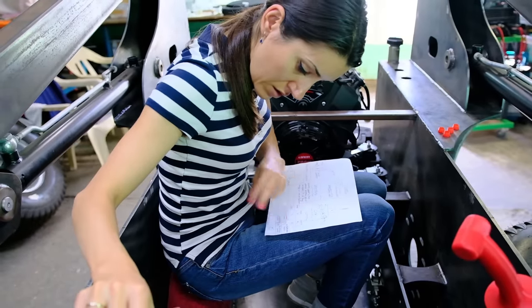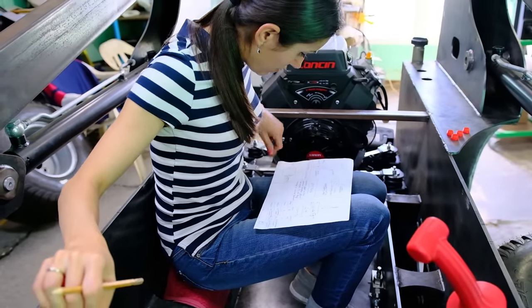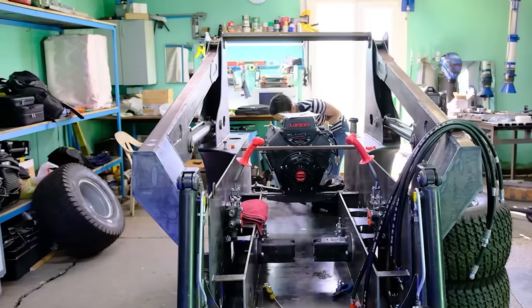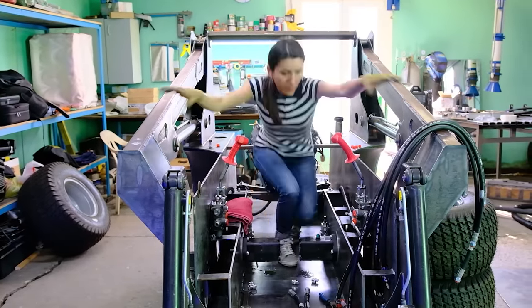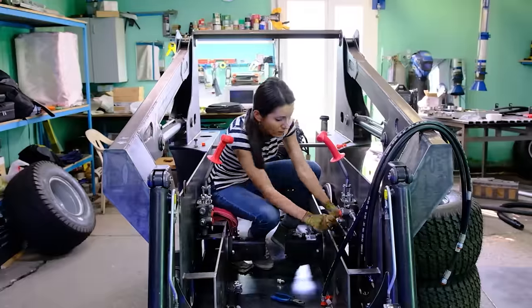In order not to get confused when connecting, I marked all the hoses and made a visual schema indicating which holes on each unit one or another hose connects to. Then I connected the first, already crimped batch of high-pressure hoses, and then did it step by step with all the other parts of the hydraulic system.